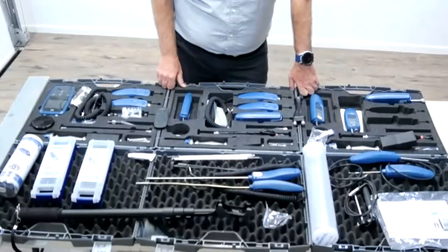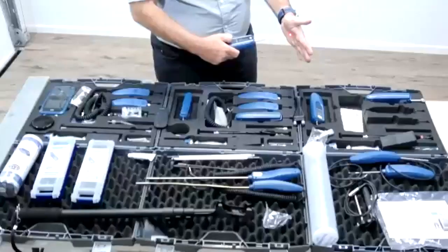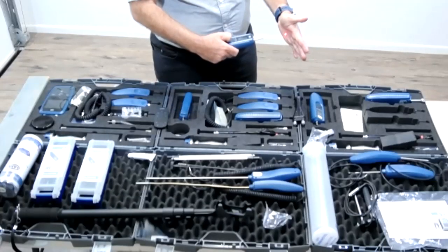And there's a little laser coming out the top, correct? A little laser, yeah. Yes, I can show you like this. Perhaps you can see it. Yes, oh yes, able to see it. You can deactivate this laser, so there's no need to have it on all the time. It still can check the surface temperature, independent of the laser. The laser is just an indicator for the point where you're measuring. You can see on my hand here, guys, the laser to get the surface temperature. Of course, if you are quite far away from a wall, you can still measure surface temperatures, but the laser will not be indicating the exact point where you're measuring, because the measuring field will be wider than that.